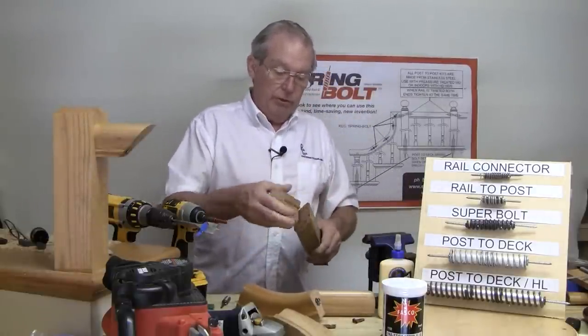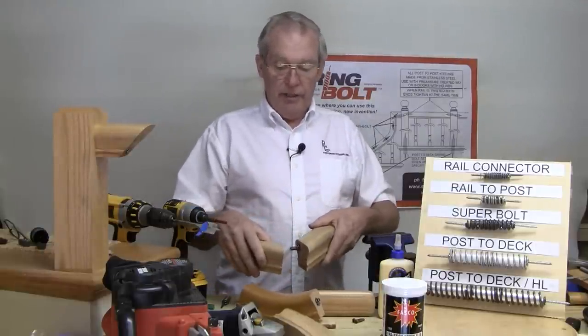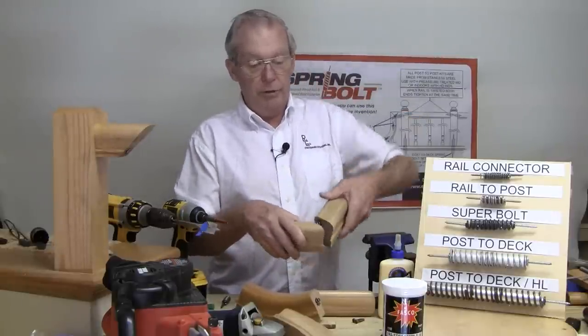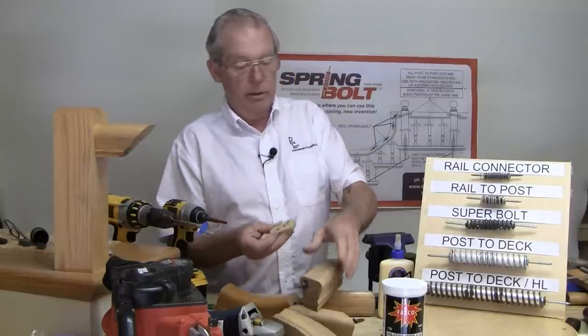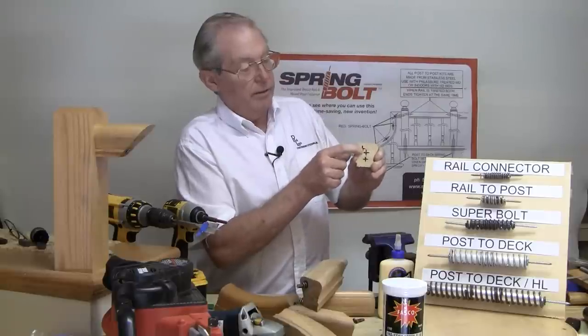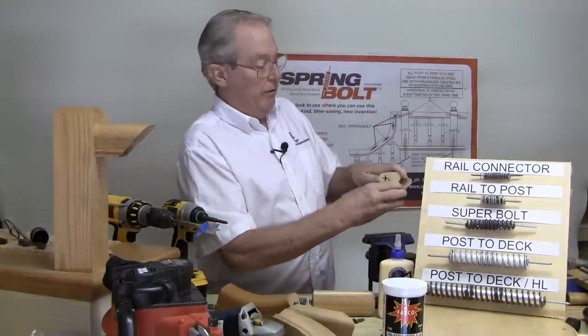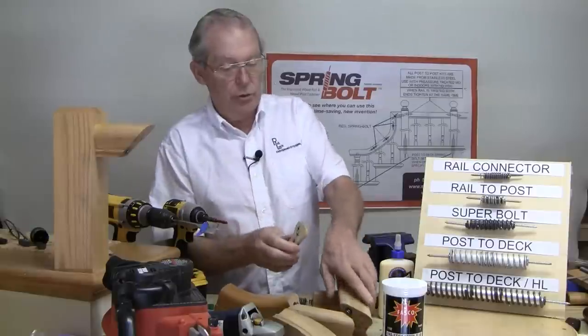In the case of your 90-degree joint to the right or to the left — I call this a level 90, a level right or a level left — you use this when you're going to bring a wall rail down and return it into a wall. You're going to place that flush with the short point and transfer the mark with your eighth-inch drill bit.